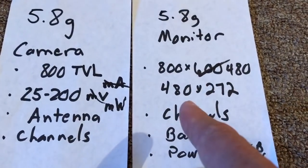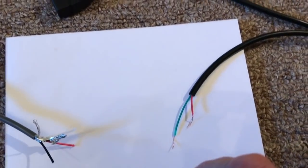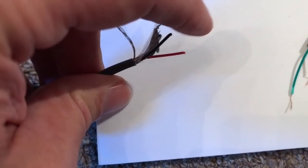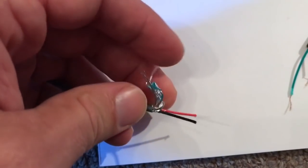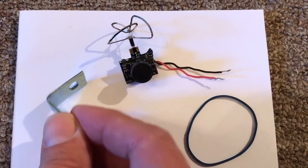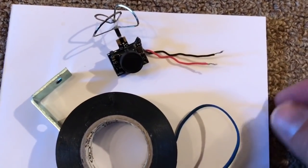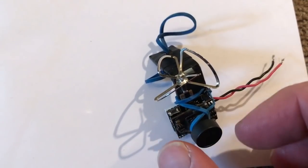I checked the voltage of the USB — the green is ground and the red is plus five volts. The nice people at Home Depot helped me pick out this wire. I was going to use telephone wire, which would work fine, but they showed me this shielded wire — it's two-strand. I want to make a holder for the camera, and I always like working with these since they tuck in nicely. Because this is going to be near the windshield, I'm going to put electrical tape over the bracket. The way they're generally mounted on quadcopters is just with a rubber band, so I've covered the bracket with electrical tape, poked a little hole, put a rubber band through, and rubber-banded the camera on.